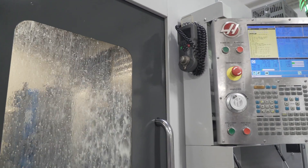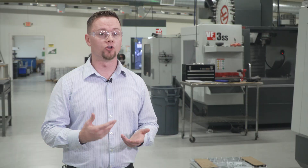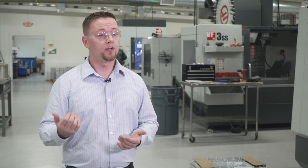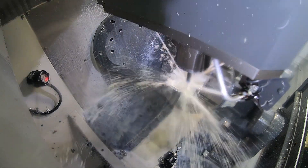When we're using high-speed machining I like to use a G187 followed with a P-value. I actually learned about that from the Haas Tip of the Day. I'm using the P-value specifically to control how the machine reads ahead.